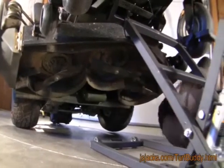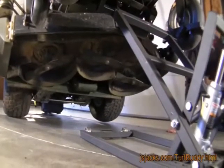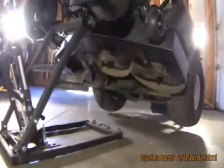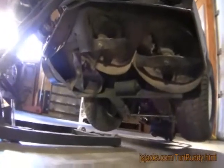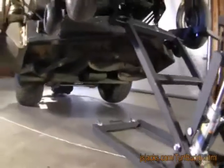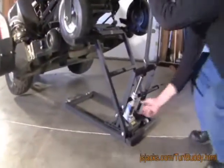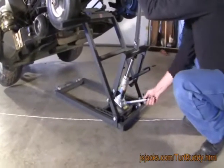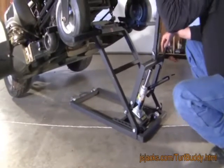Are you sharp or not? After your maintenance is complete, pump the jack lever a couple times to release the safety stops. Flip the safety stops back, release the jack valve, and slowly let the mower down.